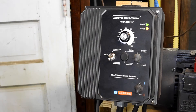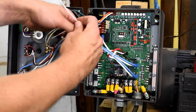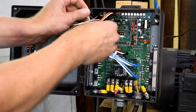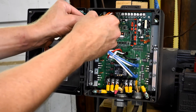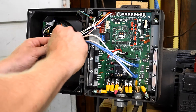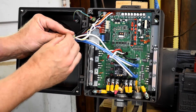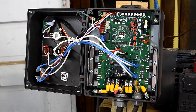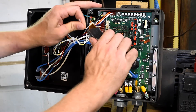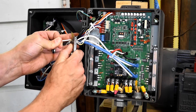I'm going to turn the power off, unplug it, open it back up, and manage the wires to make sure everything is the way it's supposed to be. My switch came with two small zip ties — everybody kind of has zip ties lying around, it just helps manage your wires. I'm going to replace the one that I cut off, adding the new wires to it. The rest of these wires, I want to make sure they have room to move on either side, so I'm just going to tie it in the middle with some extra on both sides so that if there's any tension, they have a little space to stretch. Cut off your extras — and obviously, don't cut your wires with this; a pair of wire cutters would work better.